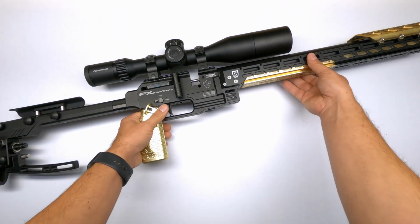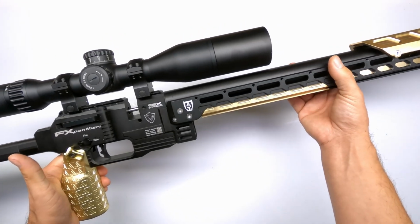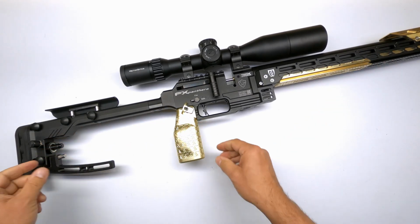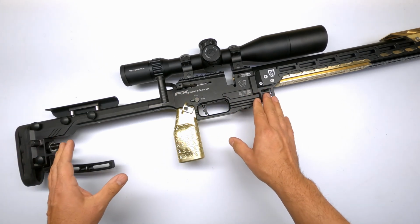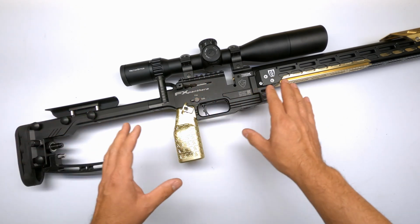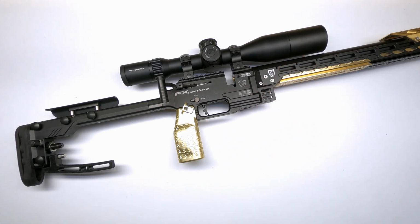And just like this, we have installed all the parts on the FX Panthera from Saber Tactical. A really cool gun right now, and I really like the bling aspect of it. The only thing we still have to do is put some air back into the system, cock everything. Now of course it is set by itself. When you want to install the bottle adapter, you have to drain the system from air. When you just install the rail, draining the system is not really necessary.